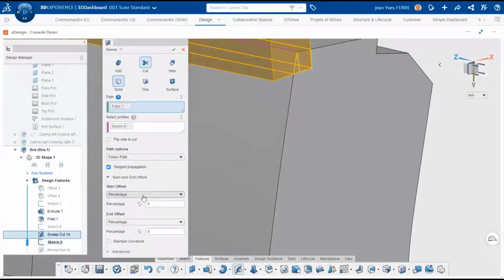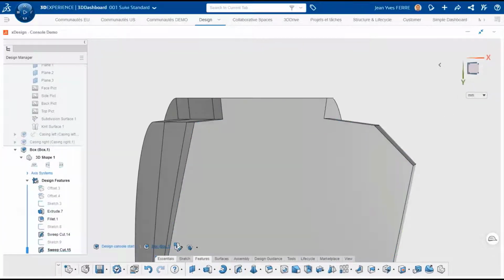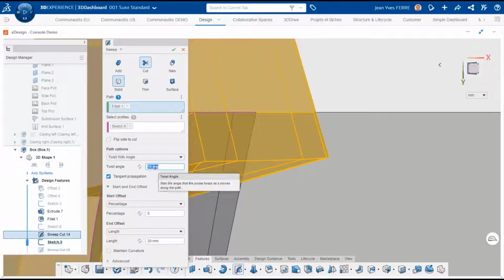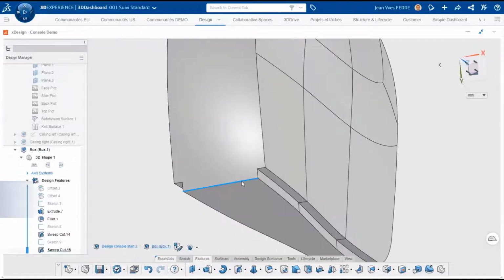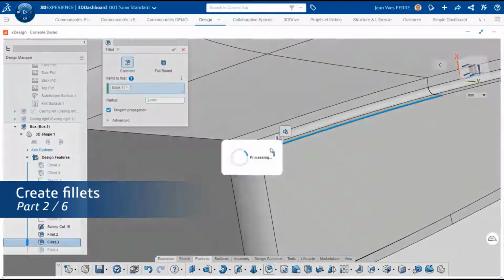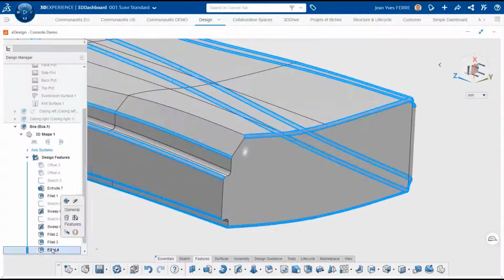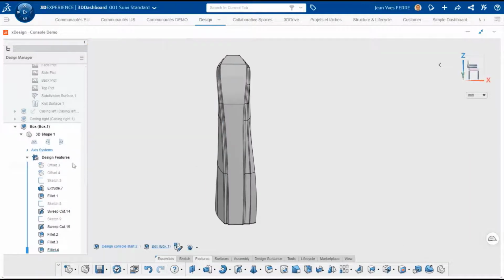Sweeps follow a curve in 3D, and these curves have a torsion. So the sweeps have a torsion too. Fortunately, we can add a twist angle to compensate for the curves, so the grooves are aligned correctly. Of course, this part is made of plastic, so it needs fillets to create an accurate mold. Tangency helps select all edges needed at once. We check the model is correct with side covers.